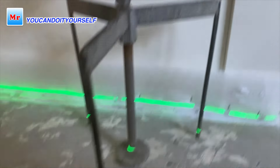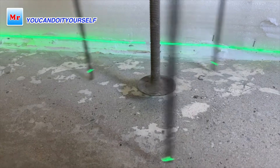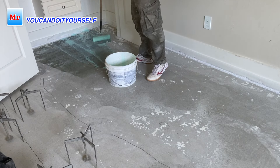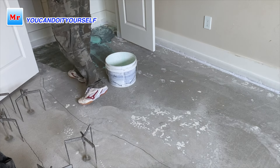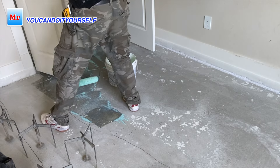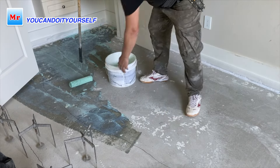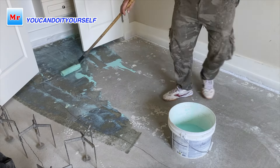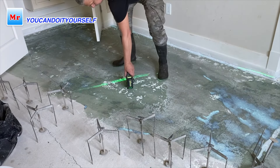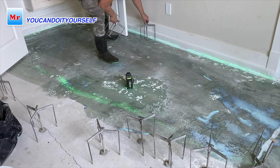These are the tripods — they show me how much self-leveling compound I need to add. The tripod has a bottom plate; I raise it up until it's on the laser line, right on the bottom edge of the plate. By this plate I fill up the concrete — very easy. These are very important tools for professionals doing leveling. I sell these tripods — you can find the link in the description. I also recommend the laser I offer because it has a very low bottom laser line, making it easy to find the low and high spots.